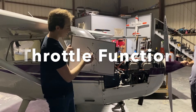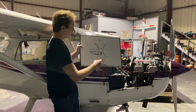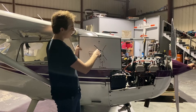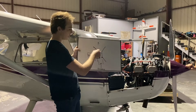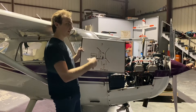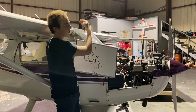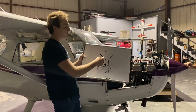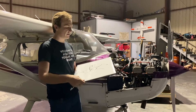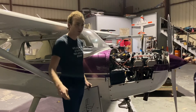This tube sits just in front of the butterfly valve. So even though the throttle may be fully closed, you're still going to get a little bit of air getting sucked around it. You have this jet that sits just outside the butterfly valve — when you start cranking and get even just a little bit of suction, this secondary tube ejects air right past the throttle. It doesn't even care that it's closed. Another key aspect of engine starting is the primer and fuel distribution.